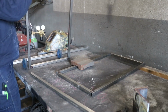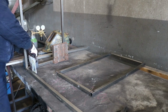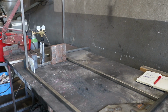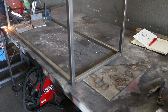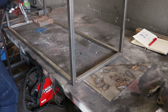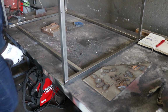Welding the legs to the cross pieces was again kinda tricky. In the end, the best method seemed to be to use a quick tack weld to hold the pieces together, while still allowing me to bend them and move them around a bit so I can get the positioning right. Adding that stretcher between the legs really pulled everything into alignment, and it provided a lot of extra stability.